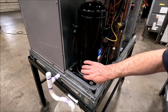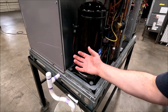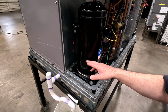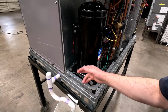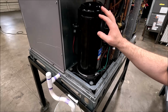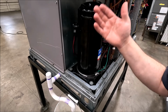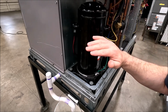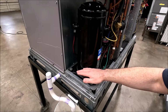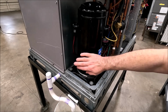But that heater is warming that steel shell of this compressor up, and it's keeping that liquid refrigerant from staying liquid. It's going to give it enough heat that any liquid that is trapped underneath your oil is going to rise up and be pumped through the system. Just like water on a road when it starts to rain, that real light drizzle, oil and the density, it will be lifted up and something can get underneath. We don't want liquid underneath there. Liquid refrigerant, we want oil, okay? That's what lubricates the bearings, keeps it going, the whole nine, okay?